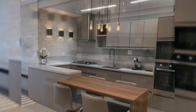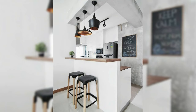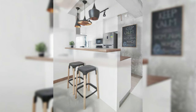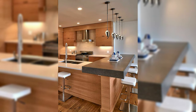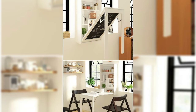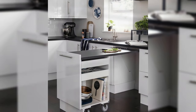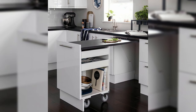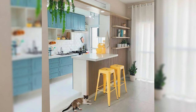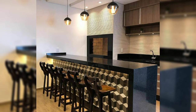36-inch workspace and eating area. This example provides the most counter area with no distinction between the eating and working space. The benefit of this height for the eating area is that it allows for hip height or counter height stools — for example, 24 to 27 inches — which are comfortable and easy to get in and out of, particularly for older adults. One potential drawback may be in keeping the work counter neat and tidy, as everything is on full display from the surrounding living areas.